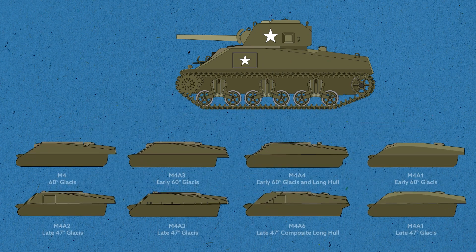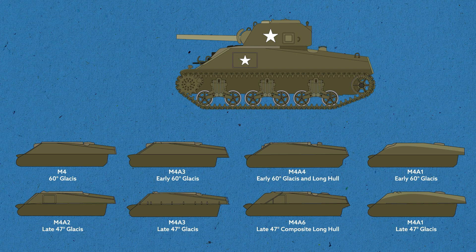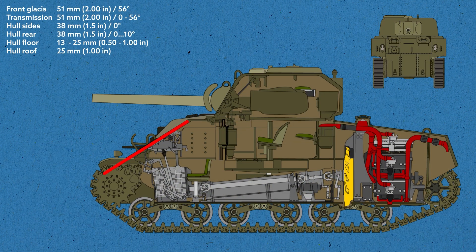The hull of most M4 tank variants had a welded construction made of rolled homogeneous armor steel plates. During the production process, there were numerous variations in the design of the tank hull, differing slightly in shape and very significantly in manufacturing technology. The tank was originally intended to have a cast hull, but due to difficulties in mass-producing castings of this size, only the M4A1 received a cast hull. Originally, Sherman's glacis plate was 50mm thick and angled at 56 degrees from the vertical, providing an effective thickness of 90mm and helping to deflect incoming projectiles. The hull sides consisted of vertically-oriented armor plates with a thickness of 38mm. The rear part had the same thickness, either vertically or at a 10-degree angle. The roof of the hull had a thickness of 25mm, and the bottom varied from 25mm under the driver and his assistant to 30mm at the rear. The M4 had a hatch on the hull bottom to dispose of spent shell casings and to provide an emergency escape route.